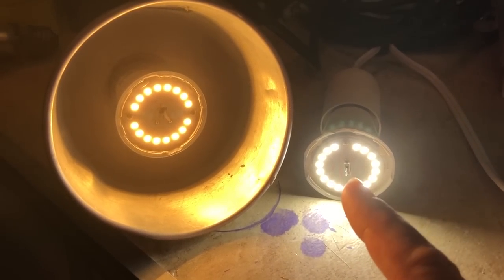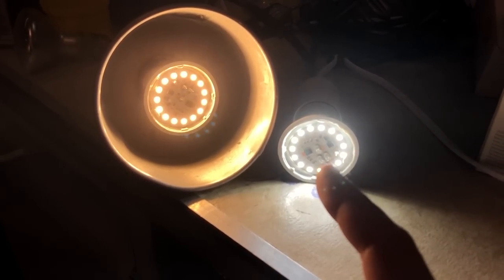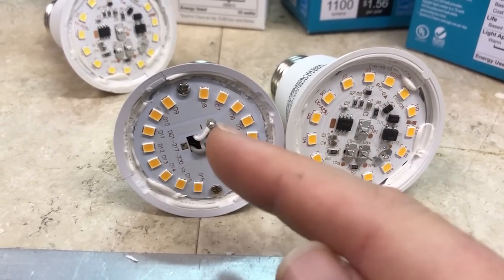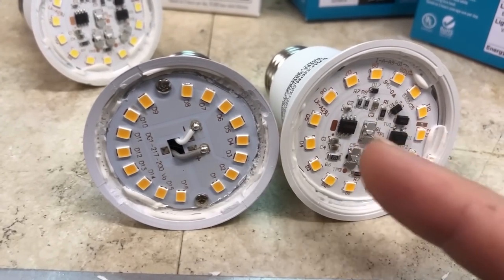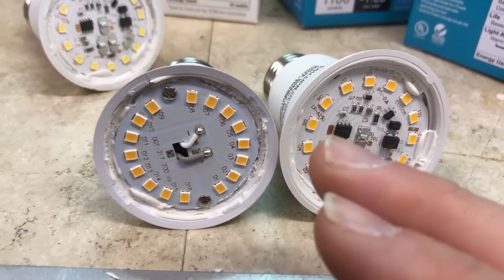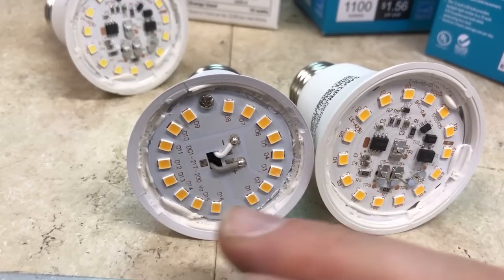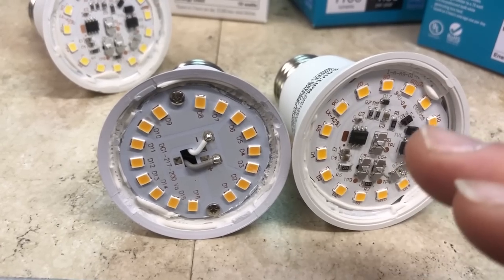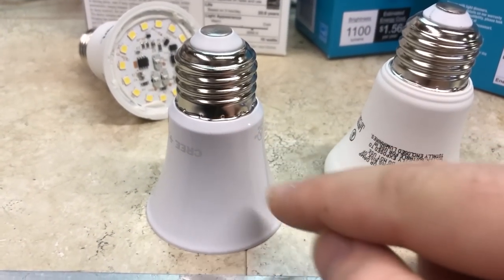Here's a side-by-side of the warm white and cool white Cree lights, and a side-by-side of the EcoSmart warm and cool white. For this video we're going with the Cree for a few reasons: its diameter is slightly smaller, allowing the discs to be closer together for better spectrum overlap. Also, the Cree uses two screws to hold the heat sink onto the diode plate, whereas the EcoSmart is siliconed in place. The entire base of the Cree acts as one big heat sink.